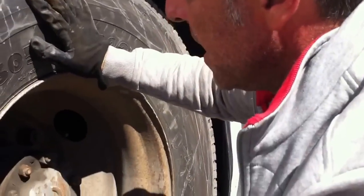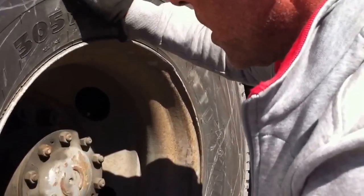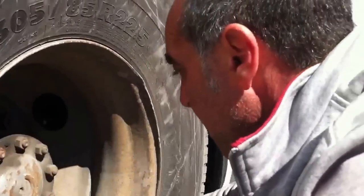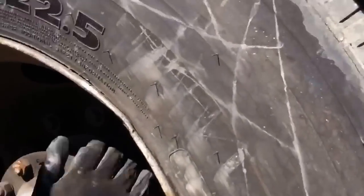If the tire wall is cut or deformed, it will be a minor defect on one and a major on both. If one of the tires has a flat or an audible air leak, that will be a major defect. The tire rim is not cracked or welded, otherwise a major defect. Both valves are not damaged. If so, it would be a minor defect. If an audible air leak, it will be a major defect.